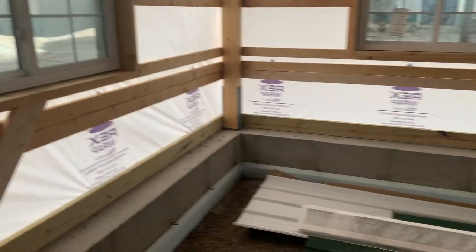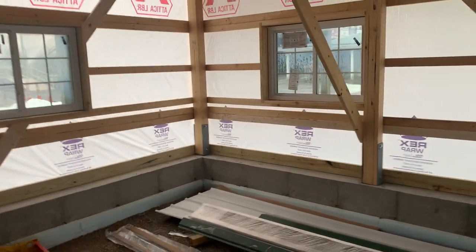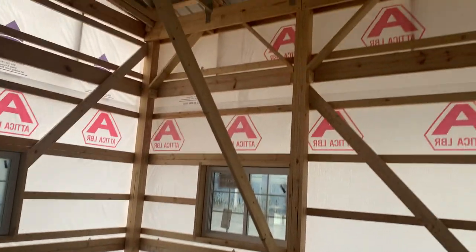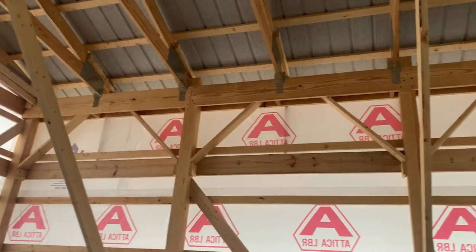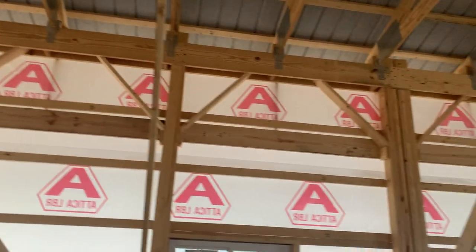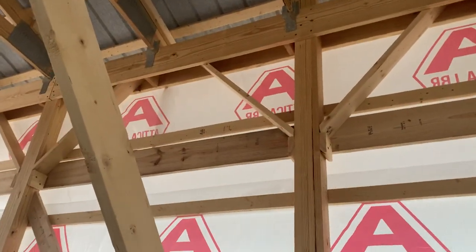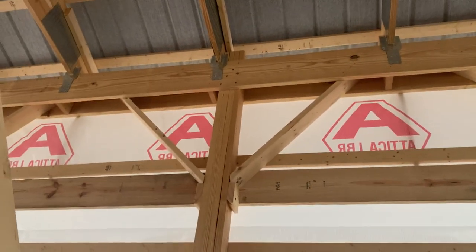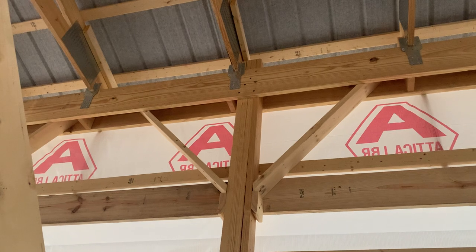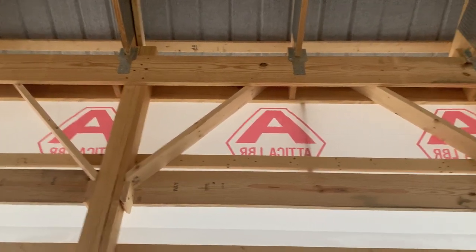A lot of the videos you've been following along this journey, we utilize 3-ply laminated columns. You've seen some with concrete permacolumns, obviously some 6x6s. But check out those hurricane ties. A lot of the videos I've been presenting and showcasing, we use actually an H1 hurricane tie, which is a smaller one. But this is obviously zoned commercial, so we used an H10. That's an H10 hurricane tie — you can see how much bigger that is compared to an H1. That was specced based on the commercial drawings.